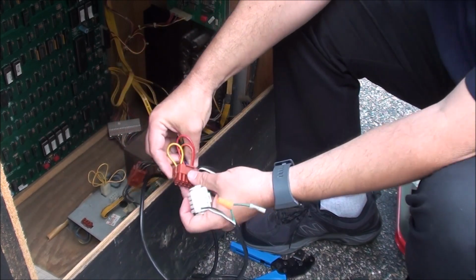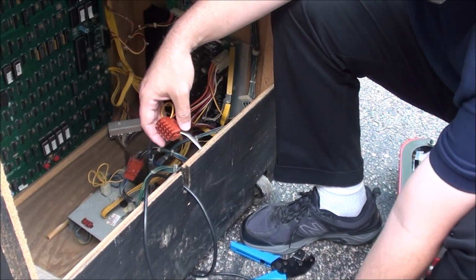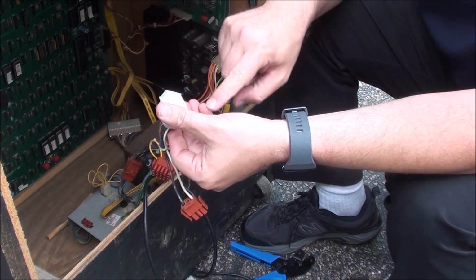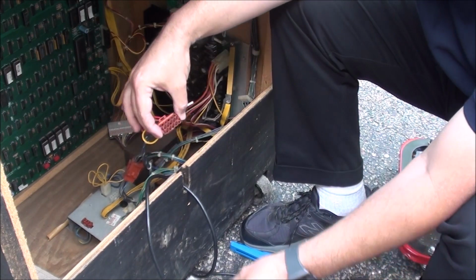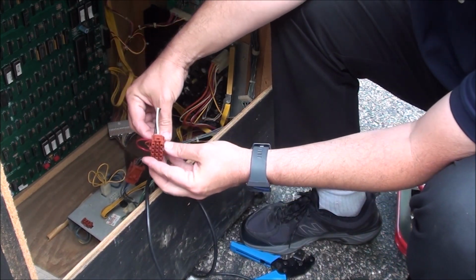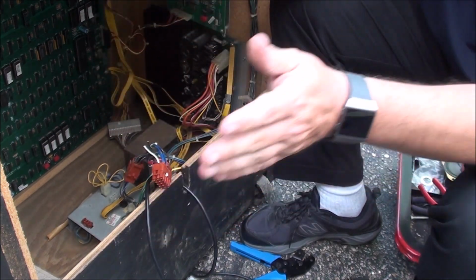along the bottom. These other loops, I don't know what the hell they were, but they're not needed. When you look at this other connector, they're not there. The only ones that are on the bottom are 4. And the receiving are all female, so these 4 on the bottom are all male. So I need to make them the male pins. And I'm just going to do them one at a time so I don't get it screwed up.